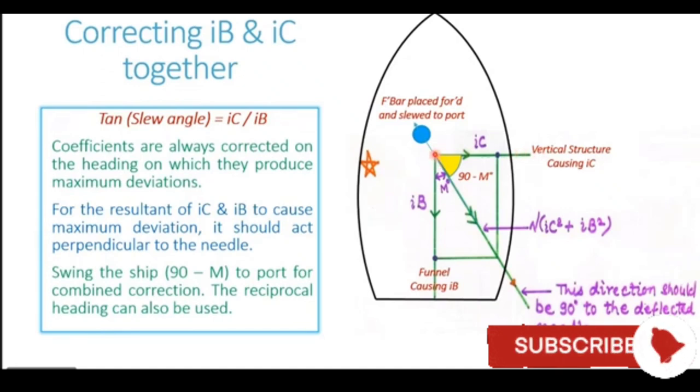generating maximum deviation. Now for this resultant to lie in the easterly direction, the vessel has to swing by an angle equal to 90 minus M. You can see the laser pointer. This is the angle by which the vessel has to be swung to the port side so that the resultant is acting in the easterly direction, which is perpendicular to the compass needle heading north and south, generating maximum deviation. So swing the ship 90 minus M degrees to port for the combined correction.